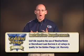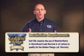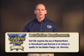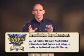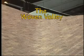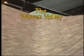That's why we require the use of Weather Watch or Storm Guard self-adhering leak barriers in all valleys to qualify for the Golden Pledge limited warranty. The woven valley is a highly waterproof valley because it leaves no exposed openings and because the two sides of the valley are usually blended together seamlessly.